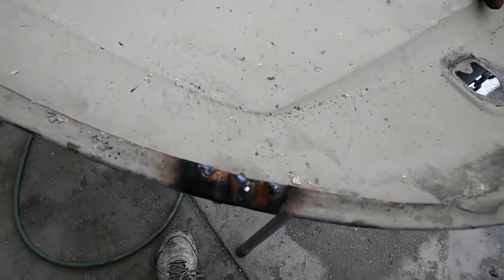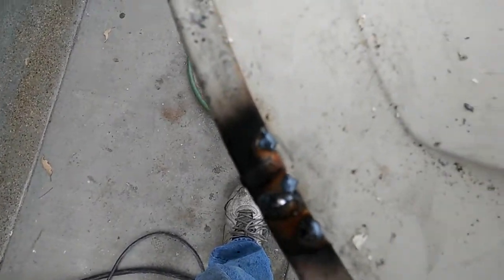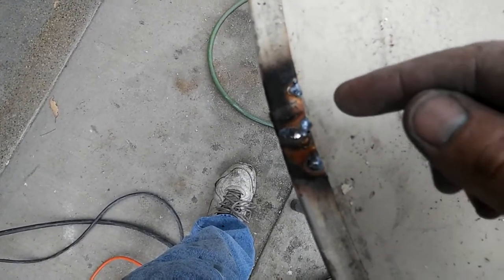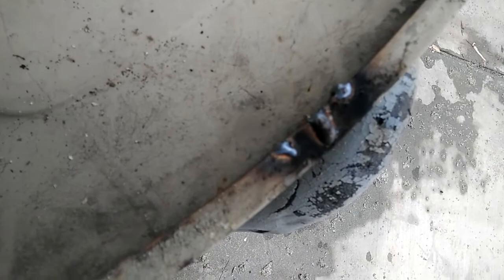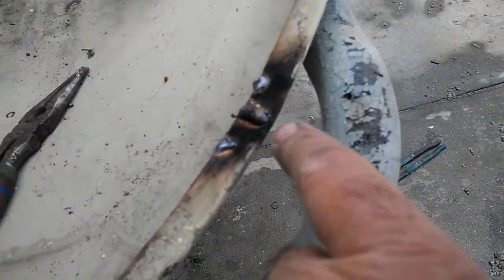Here's what I ended up with. I tried to make sure I burnt through the first layer — you guys can see that. I tried to burn through here enough to where it got the metal, then I welded here and there. When I grind this down you really won't see any signs of repair or anything like that. This is kind of a hidden repair since it didn't really crack all the way into the surface. Looking at it now I might hit this one a little bit more — it got just a little bit further than what I welded.